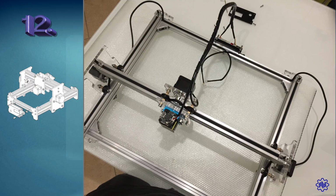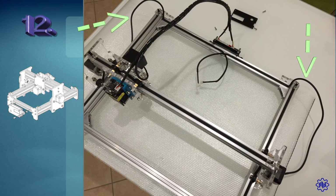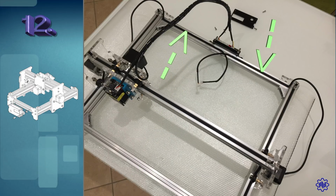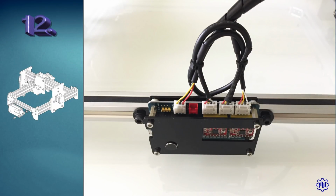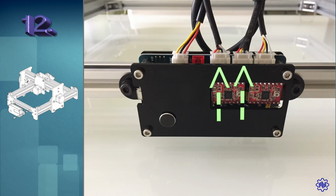Only 2 wires of equal length remain. Let's put an end to the Y-axis motors directly, leaving the right gear for free movement of the axes. We will fix the 2 ends ending with the special, firm cables, and connect their ends to the electronic board, exactly to the 2 remaining white connectors, related to Y-axis movements.